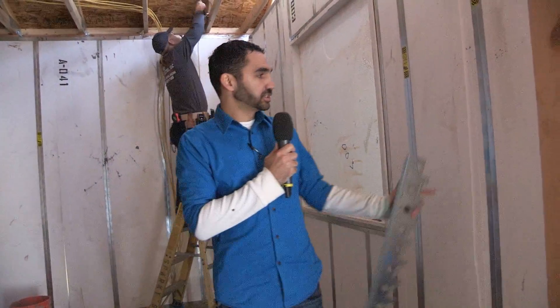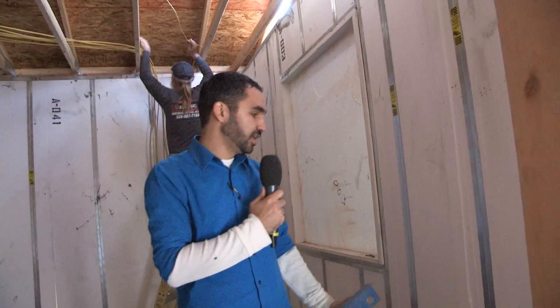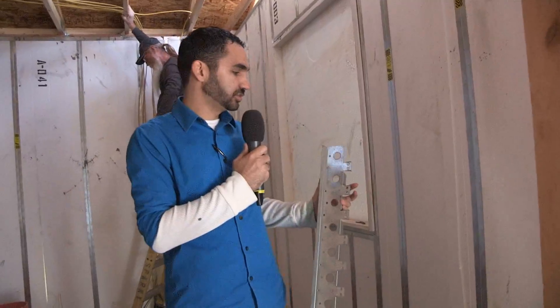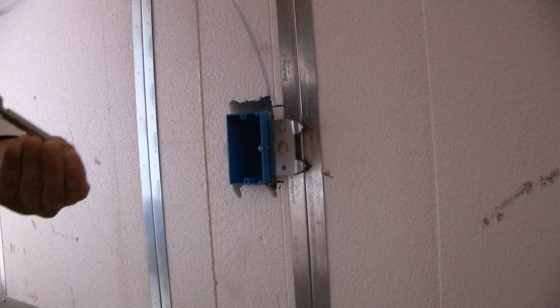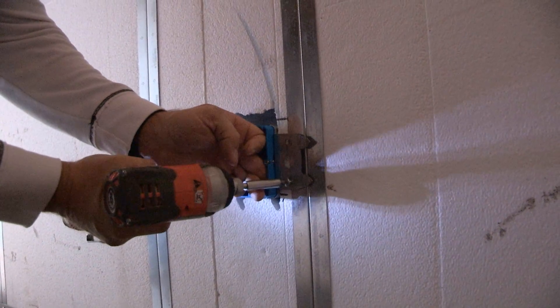The electrical chases are run vertically down from the attic. If you need to make any horizontal runs, in our shear strips we have a standard 7/8" hole that's placed every three inches on center. Jeff's going to insert the conduit box — the tab overlaps the shear strip, our metal fastening — and Jeff's going to put a screw or two through that tab into the shear strip.